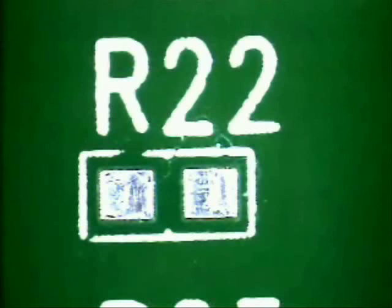The site has already been cleaned and prepped using alcohol and chem wipes. Next, you need to turn on your iron so that after your proper orientation your tip will be at the operating temperature to get a quality wetting action between board and part.